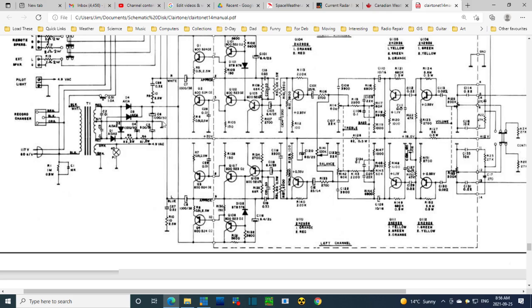So I can grab 1,000 microfarad, temporarily parallel this guy, and see if the hum goes away. That's a very good way of doing it. That's the low commitment and high results, so to speak. And you really know the story if you do that. I'm attracted to doing that right off the bat, because that could just end it. There would be no need to start poking around in here if I can get the hum out just by doing that.